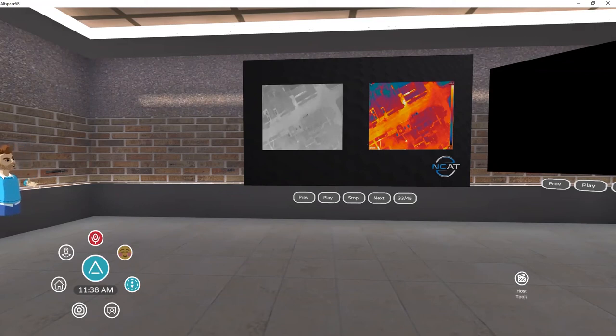On the wall over there is a thermal mosaic taken in one of the local cities near Northland College. You're looking at houses and businesses and the thermal signature radiating off of them. We were able to fly that with the UAS and provide that information back to residents, who could then determine whether they wanted to make changes to save money. In our area, we've got some very old housing, and one of the first things to go is slumping insulation or not enough insulation. With $200 worth of insulation, I was able to cut my $700 January heat bill in half.